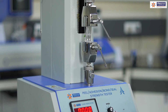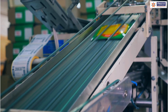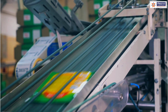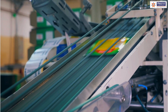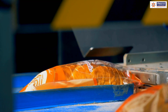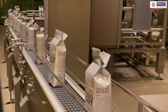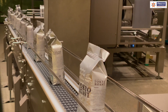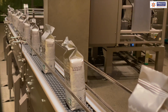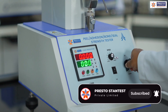The second equipment in this category is a seal strength tester. That test checks whether sealing a flexible packaging item at a fixed temperature, pressure, or time produces an appropriately strong seal. Sealing strength matters because if it is not good, the pouch will open up; if not properly tightened, air gaps can enter and spoil the contents. That is the purpose of the seal strength test.